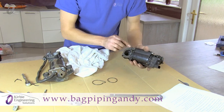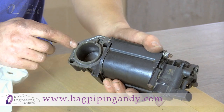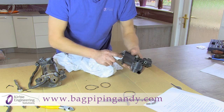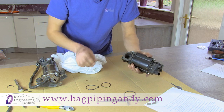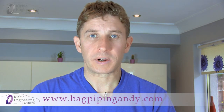Next, remove the old O-ring. Sometimes there's a lot of corrosion on the mating face, so give it a good clean-up, scraping out any loose material if needed. Wipe clean the cylinder with a dry rag, making sure there's no debris. Then fit the new O-ring — whichever is required, the shaped one or the round one. Don't use any lubrication in the system; it's designed to be dry running. Make sure both parts are clean before putting the cylinder back onto the piston.